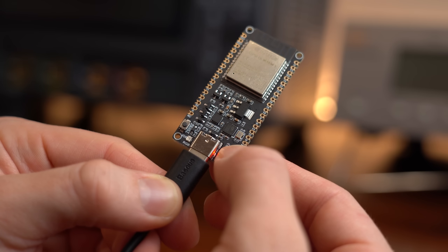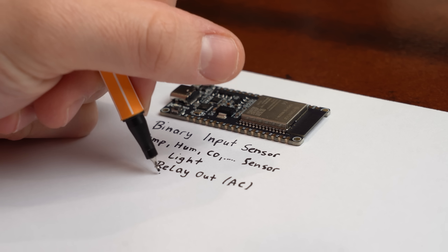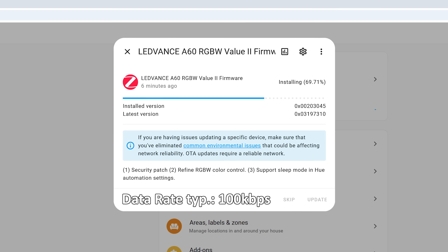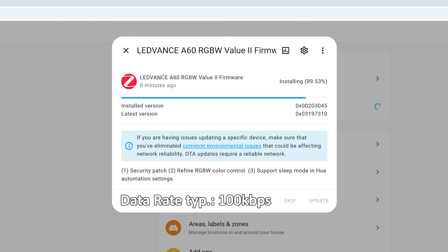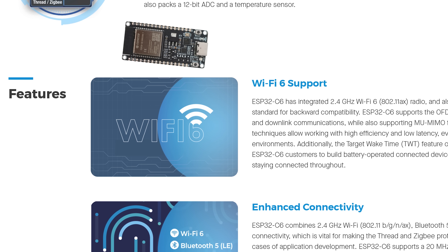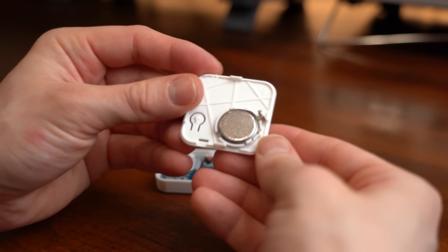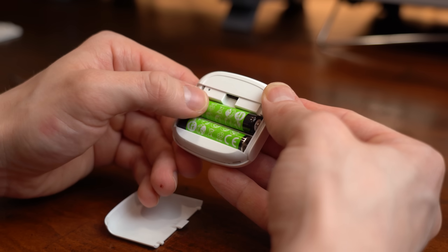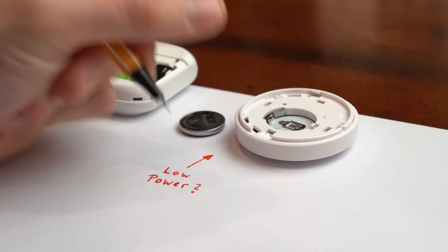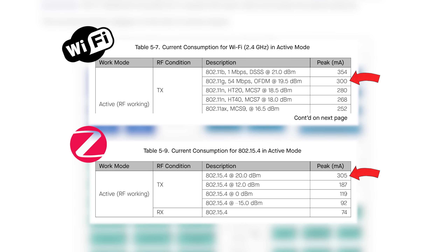What is also pretty awesome is that my ESP32 devices got immediately recognized by Home Assistant, meaning we could use them to build all kinds of DIY smart home things. But keep in mind that they can only send and receive data at a rather slow rate, proven by this update process that took 10 minutes. If we directly compare that to WiFi 6, which the ESP32-C6 also features, there is quite a big difference. But while speed is not the biggest advantage of Zigbee, you might have noticed that most of my devices here utilize batteries as their power source because Zigbee is pretty low power. However, checking the datasheet of the C6, it seems like using WiFi or Zigbee doesn't make that much of a difference on paper.